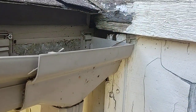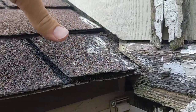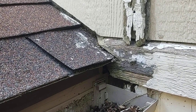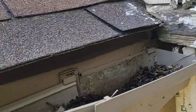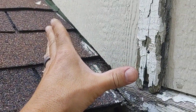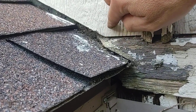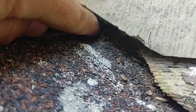This roof has been up here for a while. If you're getting ready to do your roof and you're up against something like this, a kick-out is just a simple piece of step flashing — maybe 20 to 30 cents. When you redo the roof, leave the existing flashing in place. There's one piece of flashing down here — that'd be fine. Leave it, put your new starter row under, pin it down. Take a piece of step flashing, typically taller this way where they bend it, trim it or turn it and fold it up so you've got a shorter distance. Get a little screwdriver or something and notch a small channel up here — just a little bit, enough to get a piece of flashing shoved in and worked up under and behind this piece of flashing.